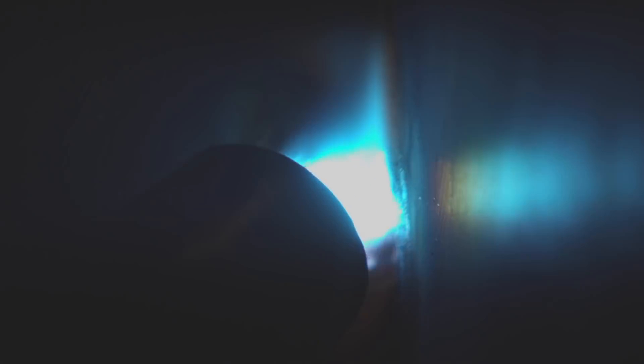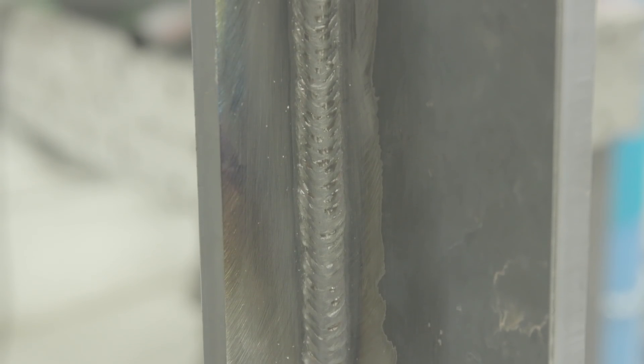As far as technique, everything went in pretty smooth. I did bury my wire a little too much toward the top and got a little bit of weld spatter — just one little BB — but I corrected that as soon as I noticed the audible change in the pulse. What I typically do is run little triangles: as I go to the apex of the triangle, it punches into the root, then I come back and let everything wet and fill in on the left and right toes. The pulse spray looks like it's punching into the root well and flowing into the plate, with minimal spatter and minimal post-weld cleanup needed.